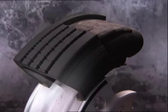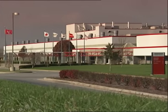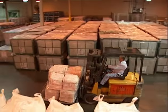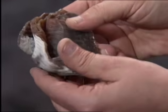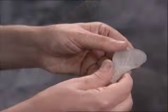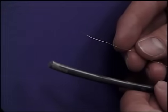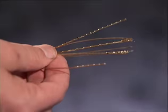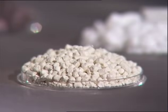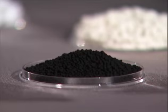We've seen all the major components of a modern radial tire. Now, how is a tire like this actually produced? To find out, we'll visit a Bridgestone Firestone truck tire factory. The basic materials are rubber and steel. About 70% of the rubber in a truck tire is natural rubber, which comes from the sap of rubber trees. About 30% is synthetic, made from petroleum and other materials. Specially made steel wire of a variety of types and thicknesses is used in the belts, body ply, and beads. There are also several specific additives used to help in processing, curing, and strengthening rubber, and in protecting tires against air, sunlight, and ozone.